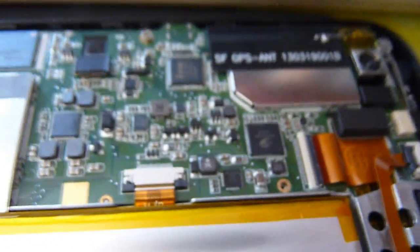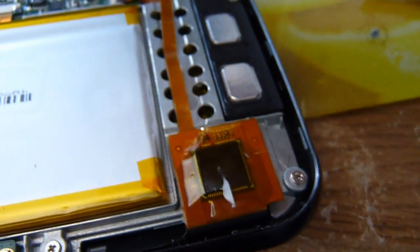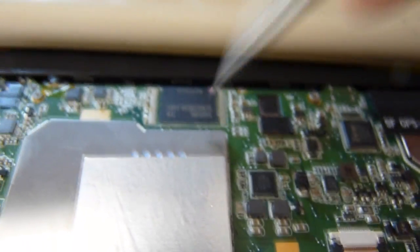This should not happen internally in a product. The design and actual layout — you've got a nice metal chassis here that holds everything together, a badass battery which still doesn't give me a long enough battery life, a very nice little speaker system, your Wi-Fi module, probably your processor module, main memory — not RAM, I mean ROM. It's all very nicely laid out, and then you come across a loose screw just floating around in the breeze. That could have easily shorted something out and done permanent damage.